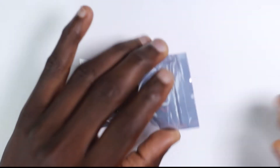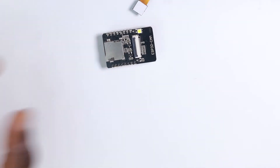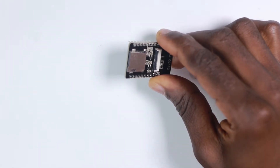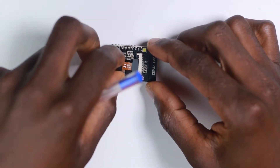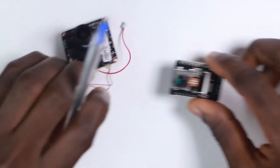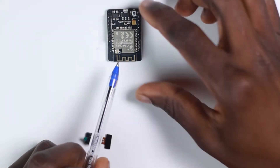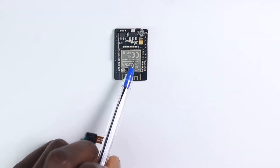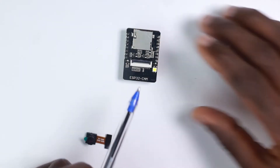This is very good. Let me show you why. This little board right here has already the memory card slot on it, so it's going to replace the one from the Arduino. It has a small camera on it, so we're not going to use that separate camera anymore. And then we have the ESP32 microcontroller, which is a 32-bit microcontroller and it has Wi-Fi and Bluetooth all on the same controller. So this is the very best option for this project.